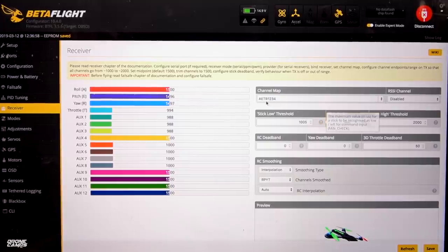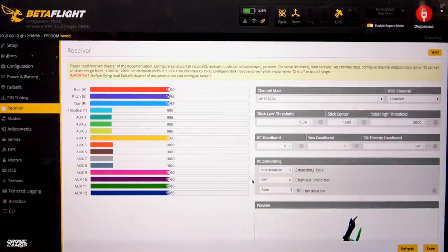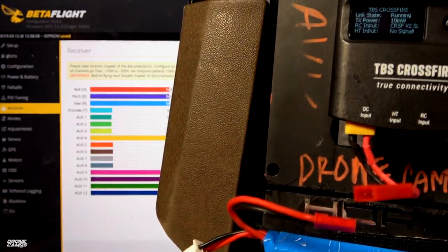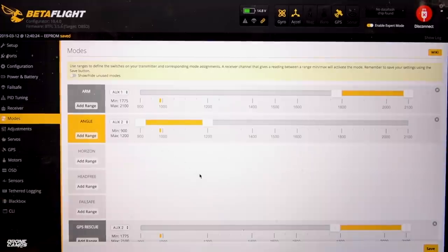Your yaw is going to be left and right up to about 2000 and back down below 1000 resting around 1500. For your roll stick on the right stick, left, right, forward and back — that's how that should look. If it does not look like I have here, you need to make sure that your channel map is set over here to AETR1234. You might need to go into your radio and make sure things are changed around to be working correctly. If things are all messed up in here, you can also go into your Crossfire module and make sure that your outputs are set correctly to RX-TX.